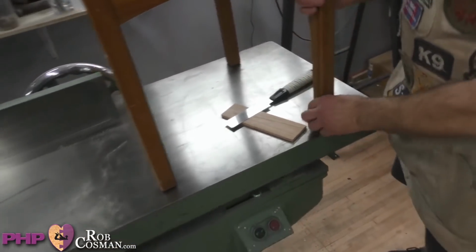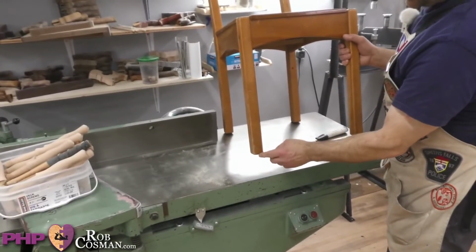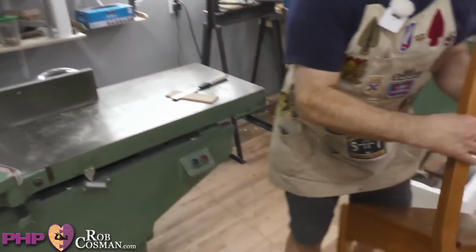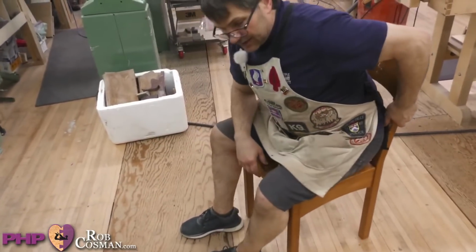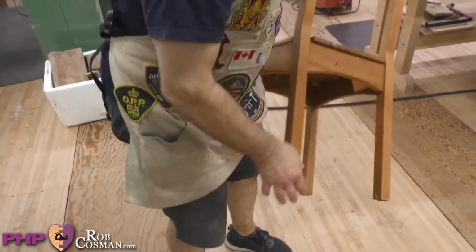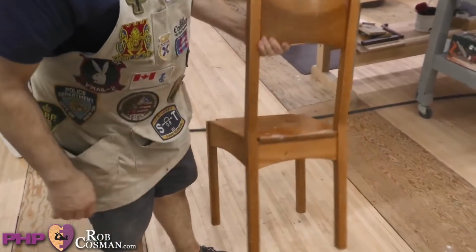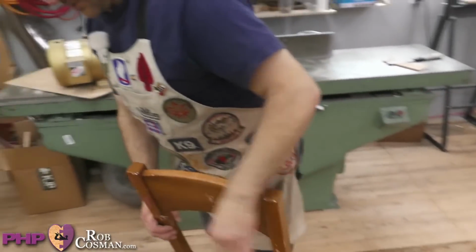And you always want to make sure that you either chamfer or quarter round the bottom edge. If you don't, whenever somebody sits in this chair at your dining room table, and when they go to get up, they push back like this. Well, if that catches anything, and if that doesn't have a protective chamfer or radius, it's going to break fibers off of there, and it'll just keep going and getting worse and worse. So that's how I trim the leg of a chair.